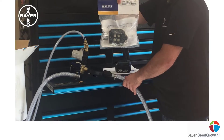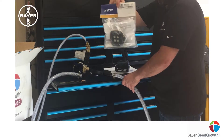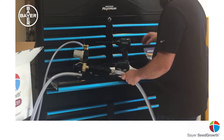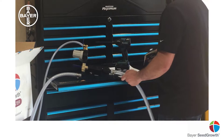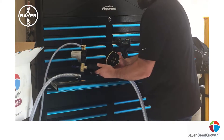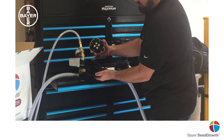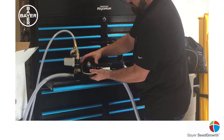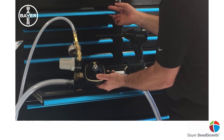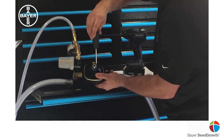This is what you're looking for — this is the replacement diaphragm kit. There are instructions in here on how to get at it. Rather than open this one up, I'll just show you. You take the new diaphragm, see how this side lines up with this here — place it on. I recommend, because this is all plastic, do not use a nut driver when tightening.